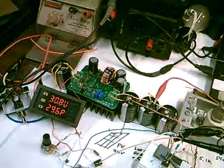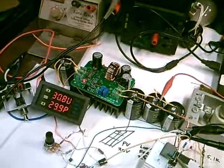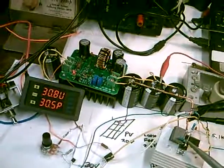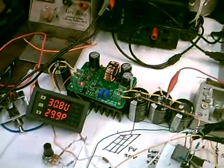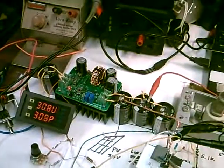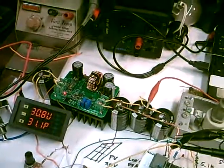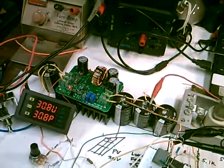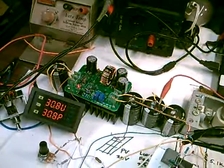It's a snowy, wintry day. It's nasty outside. It's about 11 o'clock. And we're putting 30 watts into the water heater. And that may not sound that much, but a water heater typically loses about 50 watt hours every hour. So this is at least preventing some loss.